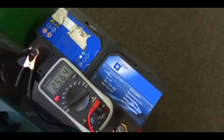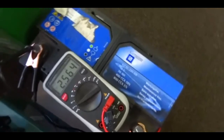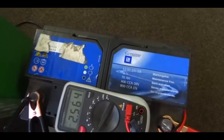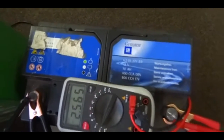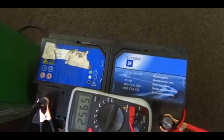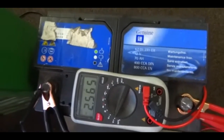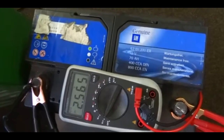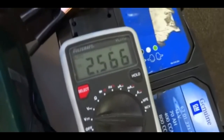The Nissan battery was one I had gotten - I'll blend in a picture from my ad when I sold it. It was a battery from the recycling station, and I had used regular chargers first but also different Bedinis. Once it got over 14 volts I used Bedinis just because Bedinis are really slow at putting charge into a battery, but they're great at getting rid of sulfation.